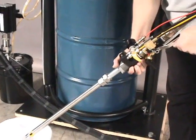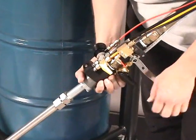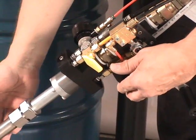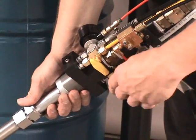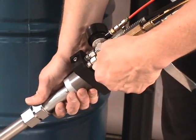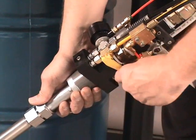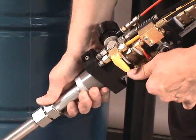Once you are finished, you will turn the valve in the off position. You can then purge the bulk of the resin, putty, and catalyzed material out of the mixer by turning the solvent valve on first, then air flush, solvent flush, and air flush.